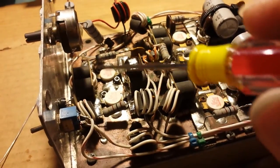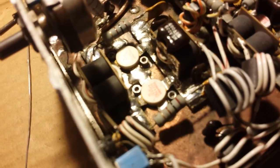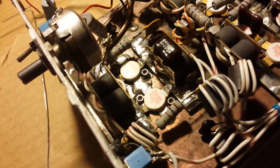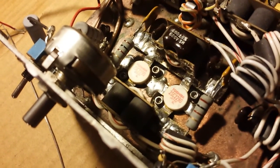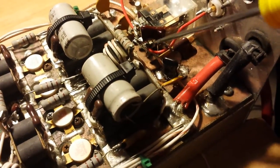Let's go ahead and let you see how it is. All we had to do was install these two transistors — those were blown. Put two brand new non-dot 2290s in. Suckers are 40 bucks a piece right now. We had to retune the output.